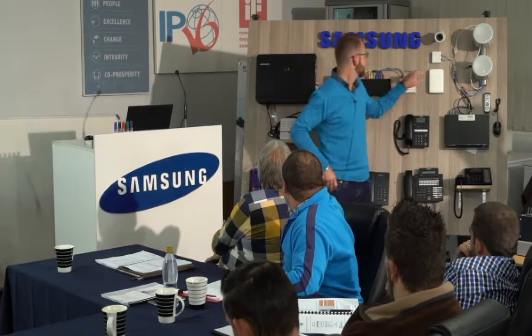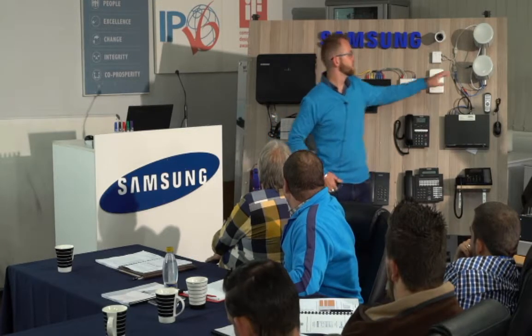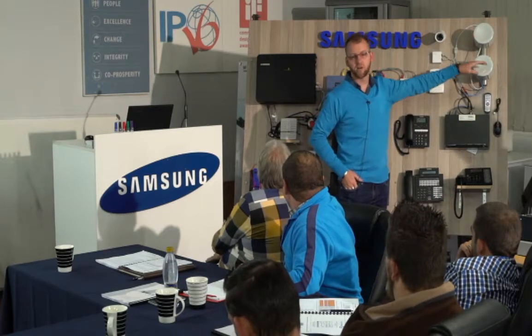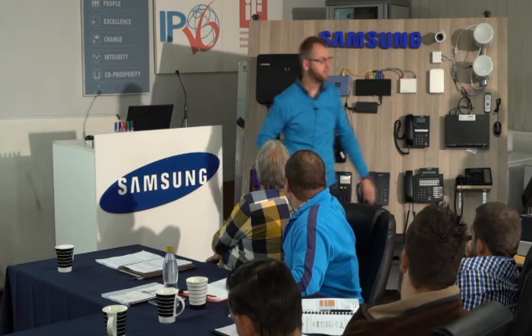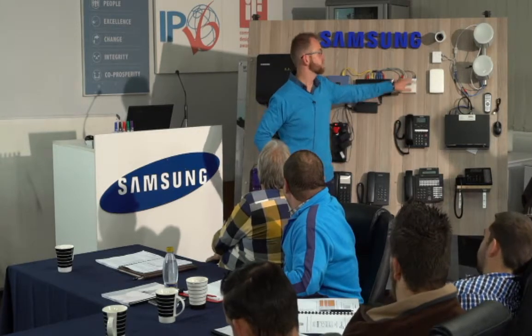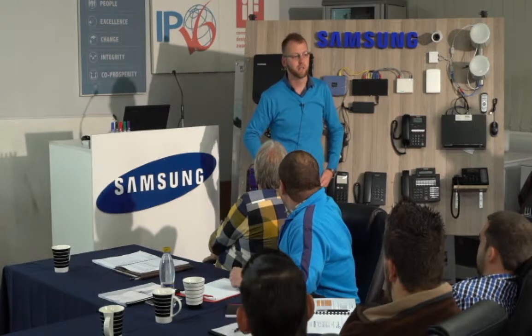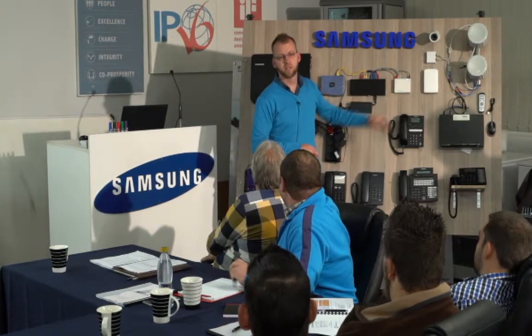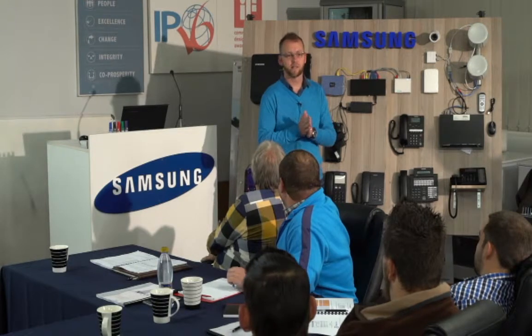If Vodacom's towers in the area go down, or the LTE APN on Vodacom goes down for any reason, this device monitors the traffic via here, and then it's got another rule to monitor traffic via there. So if it can't see the destination via here, it moves it over that side. Okay. So it's an automatic failover from this device. The failover, monitoring the two links, is nearly immediate. Let's take worst case, say 10 seconds. You can log into this device, go to the routes, and see exactly the failover when it happens.